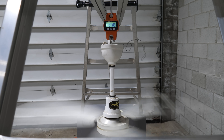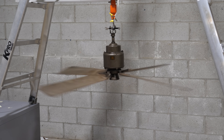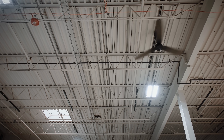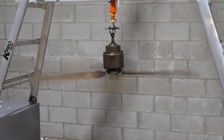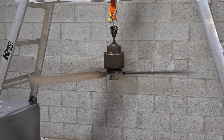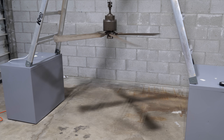And speaking of heat recovery, here's another fan to test! This is an Emerson heat fan, a commercial fan designed for buildings with high ceilings to push the warm air collecting against the ceiling back down so people on the floor can feel all that warmth, and the heat doesn't have to run so much. This was a product of the energy crisis of the 70s, and someone at Emerson realized, hey, we make motors! Why not take one of our washing machine motor housings, stick some fan blades on there, and sell it as a heat recovery fan? And that's what this is! Because it's got a big ol' motor powering the thing, it can move a lot of air.